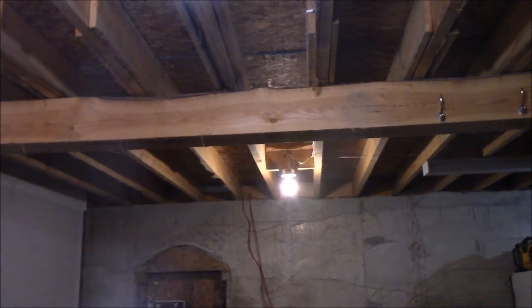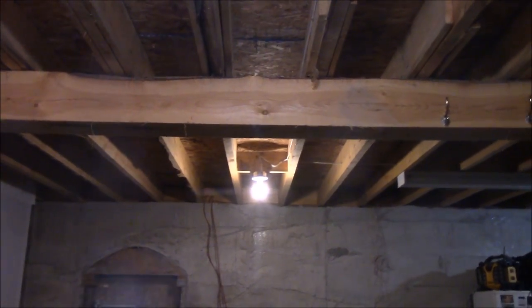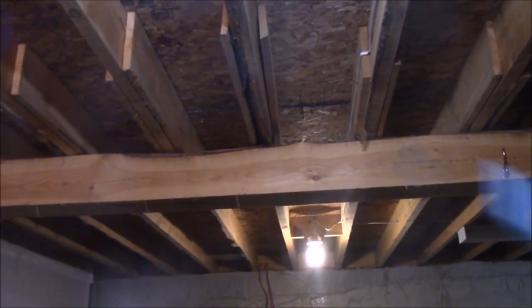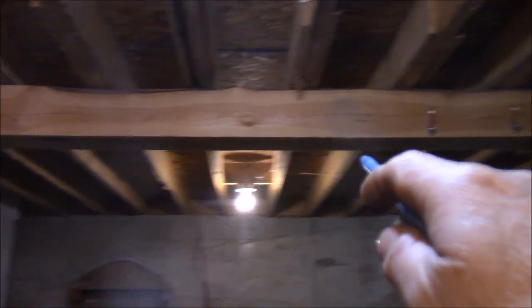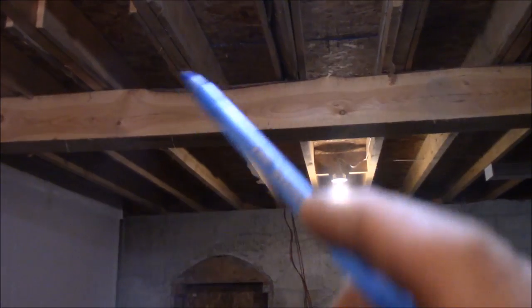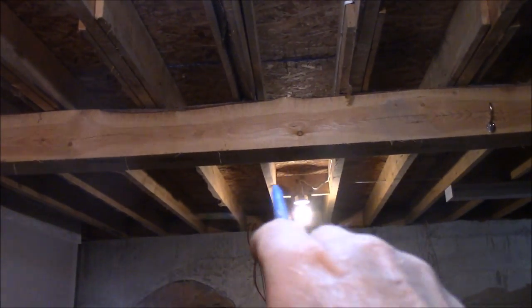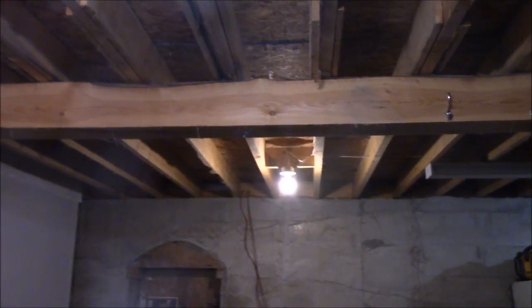It's been a while now. I don't think I did it at Heather's mom and dad's when I did it, but just something never happened. Like, you know, I was reading and it's pretty good too, because if that light should go out, if something happens, then I lose all the power over to that light, and vice versa, whereas when I twist them together like that, one light can go out and it'll still continue, and it won't affect it if I get a short in that light. If that socket burns out or a wire, I'll still have lights continuing on through.